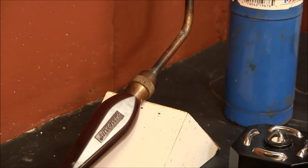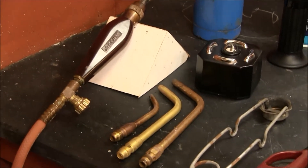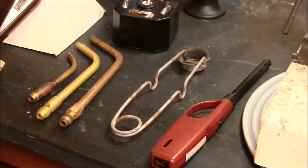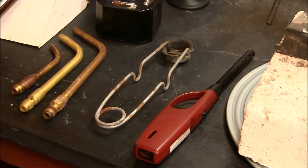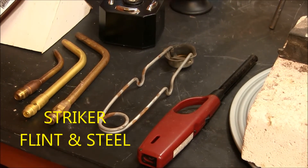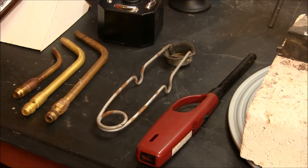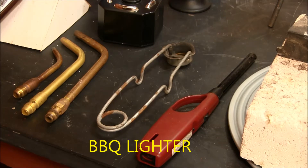This is a one-fuel torch using acetylene and it does not have a self-striker on it, so you have to start it using something. You can use either the old-fashioned striker right here — this is a flint and steel striker. You simply squeeze it and it strikes the flint on the little steel cup, produces a spark, and then it'll light your torch. Or you can use the barbecue grill starter, which is kind of convenient also.